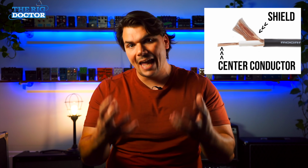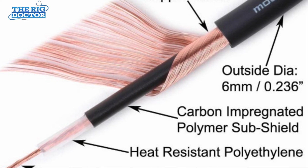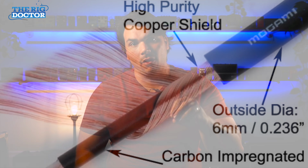They're soldered and encapsulated onto the connector itself so that you don't have any risk of oxidation or corrosion of those connections. Now, oxidation and corrosion are inherent in most of the types of materials that are in cables, primarily copper, but you're mitigating the risk as much as possible when you encapsulate those exposed conductors and the exposed shield and completely entrap that on the lugs.